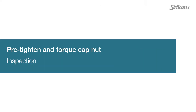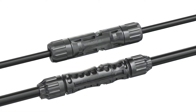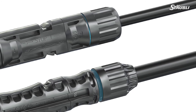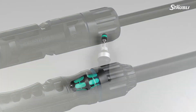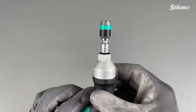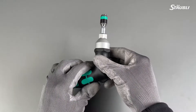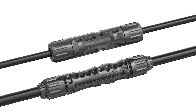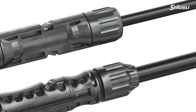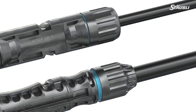Look for the following visual cues. Make sure that the nut isn't canted off to an angle. Verify that there is a small gap between the insulator and the base of the nut. The determining factor that proves you have the right gap distance is the use of a torque tool calibrated at the correct torque force, which is dependent on your wire cross-section. Always verify that the cap nut is not bottomed out. For connectors that come already assembled on the PV module or other components, do not tamper or modify the gap.